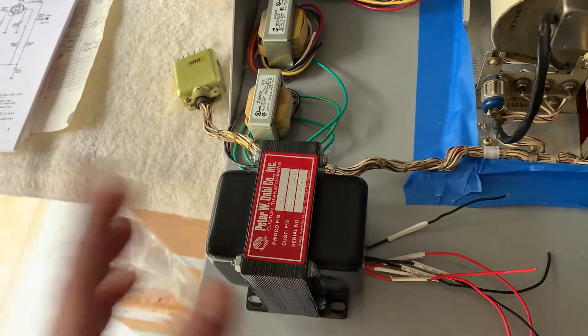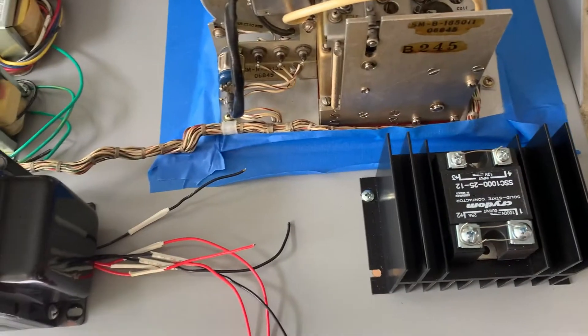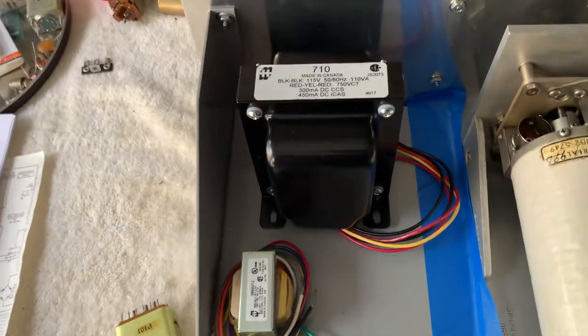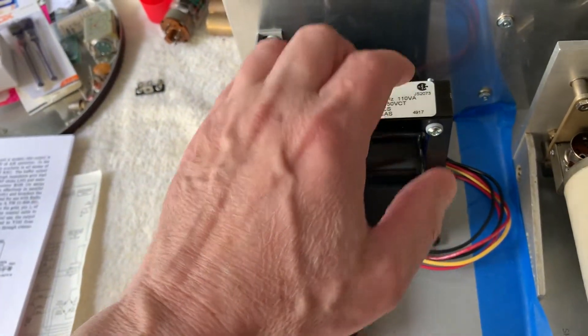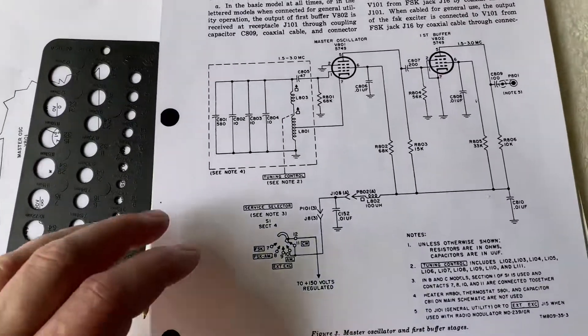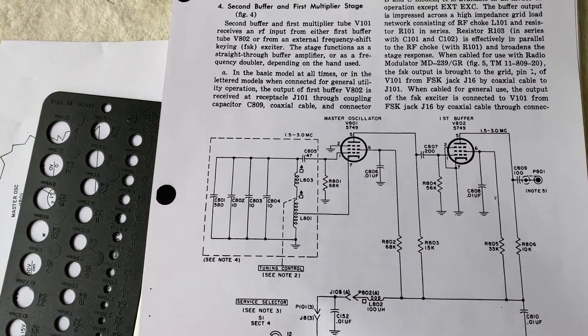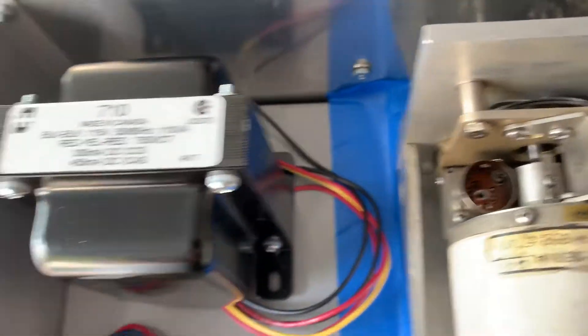It's like 500 volts and it'll work fine. I can dial that down to the 200 volts I need with the control unit. What I'm going to do is make three regulated supplies from this. I did get a hold of all the information and I do need the plus 150 volts — that goes to the PTO, these two tubes here, the oscillator and the buffer.